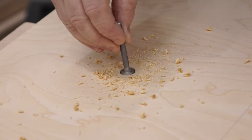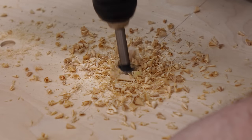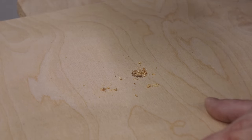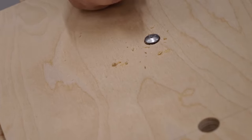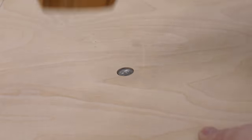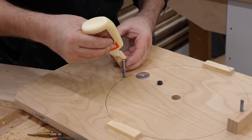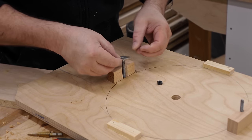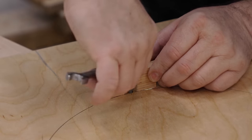While I'm at it I'm going to get the hole drilled in the middle as well. To install these carriage bolts I like to get a little bit of glue underneath the head — this is optional if you're going to just put the table on and leave it on there, then there's not much point doing this. The taller locator blocks have notches in the side that go around the carriage bolt, and then I'm going to use the carriage bolt plus a washer and nut to clamp those in place until it dries.